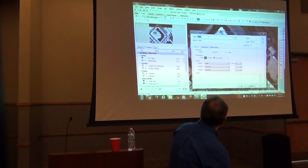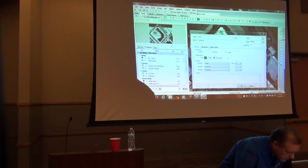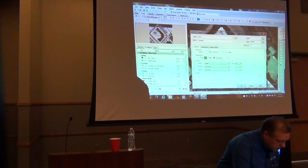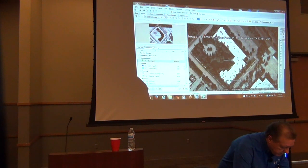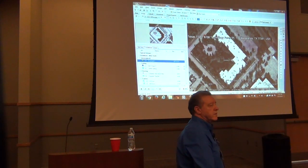I'm going to create a condition here that is a 3-foot parapet. Fill. And I'm going to set the wall height at 3 foot. I'm going to set the thickness to a large number here so we can see it because the scale is so large. And I'm going to start right here. Just going to do a couple of spots here. Sloppy. And there's 607 linear foot of 3-foot parapet off of a Google Earth photo.